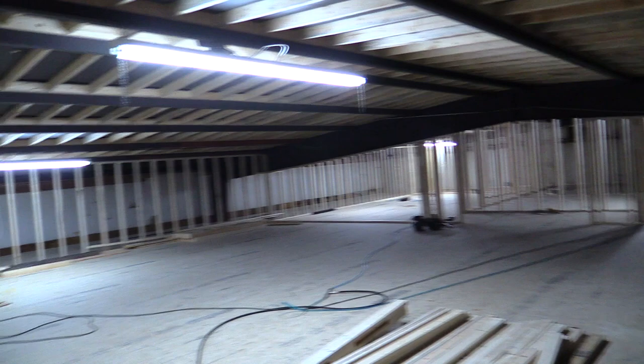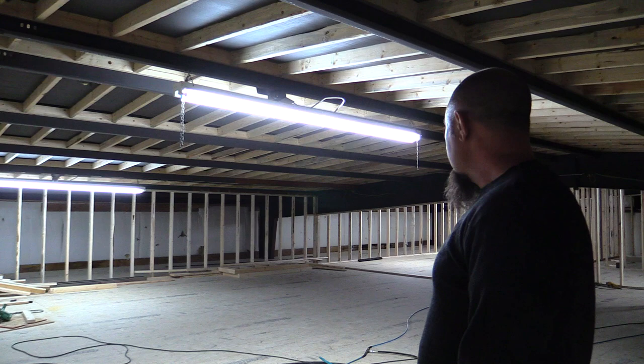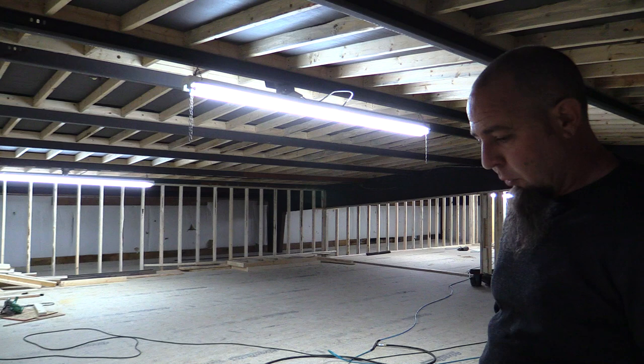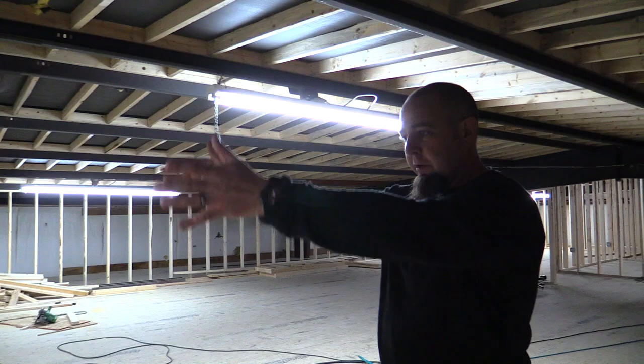Every time we come in there's more progress — from when we were here this morning, now there's a lot more down there, starting to put in all the receptacles, outlets, and switches. Now we're looking at floor products — tile and carpet. I think we're using a heavy traffic carpet tile by Mohawk. It has a kind of a one-directional pattern with lines and ridges. Down the middle three feet we'll have all tiles facing one direction, and then we'll stagger them into a pattern off to the sides.